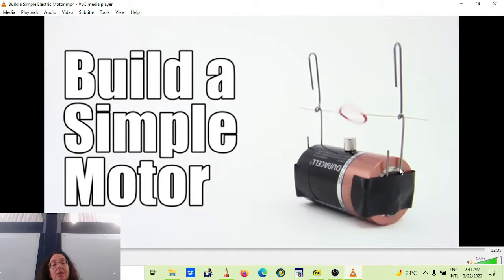So, for example, here, you're going to have current flowing, loop, loop, loop, loop. So that little loop will become a magnet. You can even see if the current flows this way, north will be down, and south will be on the other side. And then you go back here. Because I have a magnet here, it's going to spin until north here is facing south. And there is no trick, there is no secret. Then my loop will be stuck and it stops spinning.